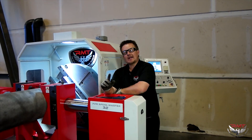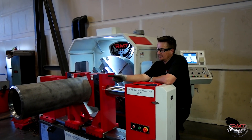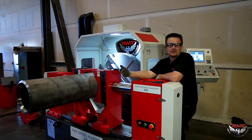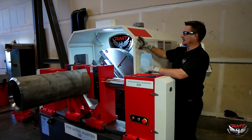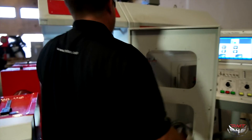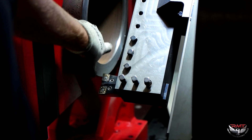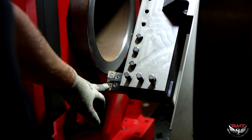I'm Kyle Jorgensen. Right now I've got a piece of 12-inch P91 pipe in the Pipemaster. This is a 32-inch Pipemaster. That particular pipe has a wall of 1.337 and I'm going to program a U bevel on the machine. I'm going to program it with a counterbore or the tapered counterbore. We're using our standard universal tool which allows us to do a counterbore plus machine the face of our pipe.